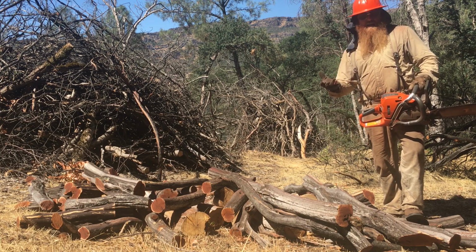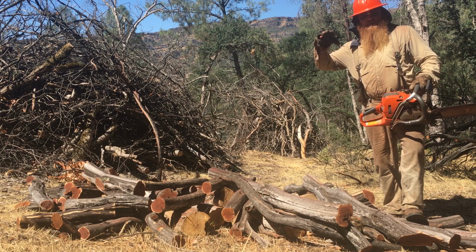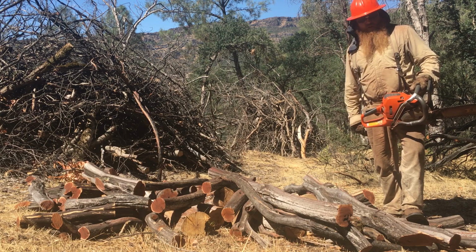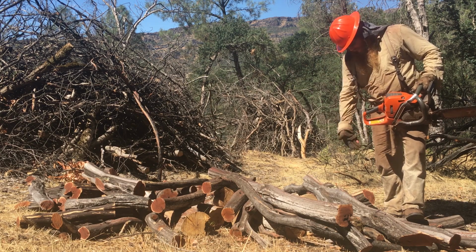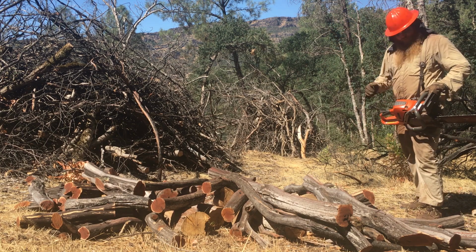It's better to actually have a medium intensity sharpness to your cutters, and you also want to have the rakers set relatively high, just a little bit below your working corner, so that that will also prevent you from pulling the wood into your shins. Less talking, more doing. Let's get it.